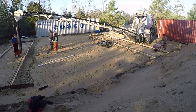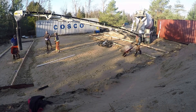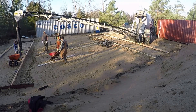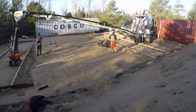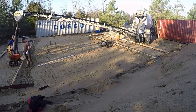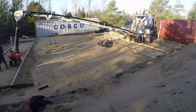If you look closely, you can actually see the rebar — two runs of rebar all the way around, all four sides of each form. 15 mil rebar. The pink standoffs that you see there are just a little bit of scrap foam board that I had. We decided to go eight inches all the way through the pad instead of just thickening the edges.